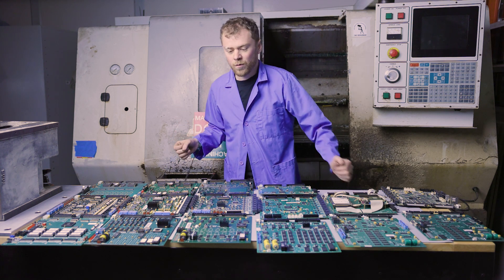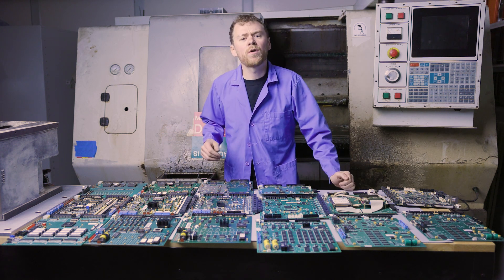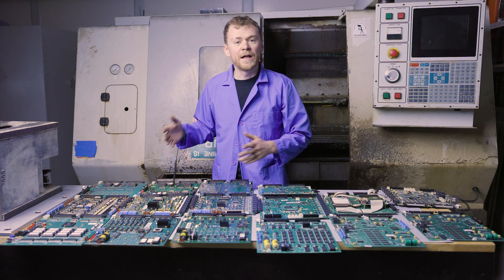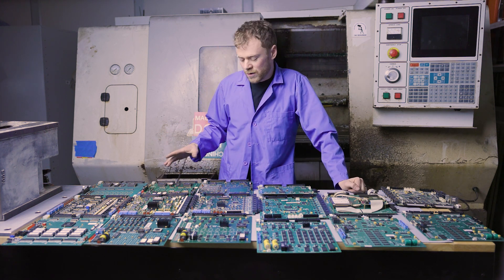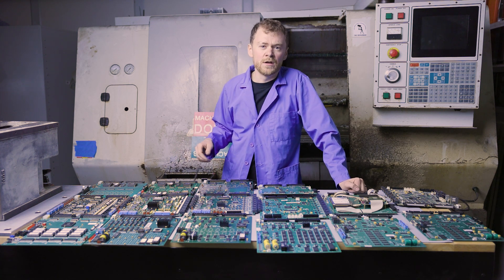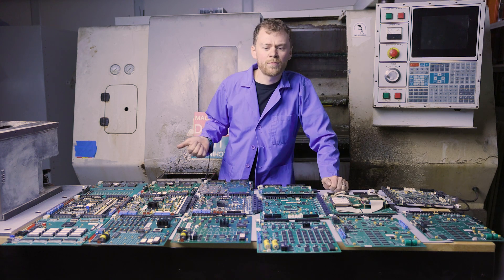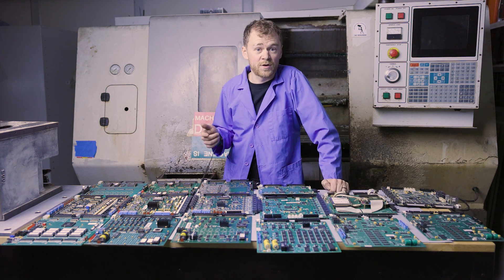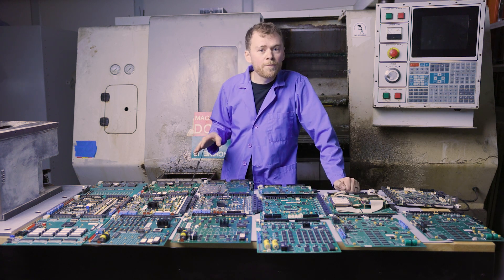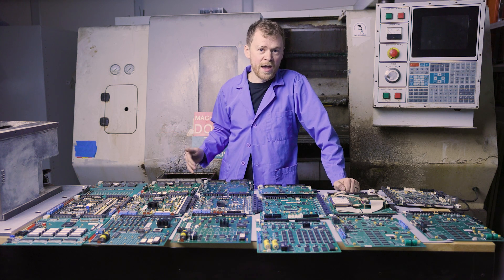From there, going to 1997–1998, we move to AC motors but still with a spindle drive. That's when they brought in the MoCon board. At that point they were looking ahead and made a newer video card, still running CRT. They bumped to a newer processor with a bit more memory, a faster processor, and an updated MoCon board. The MoCon board is the board that controls the motors and everything you do with the I/O board.